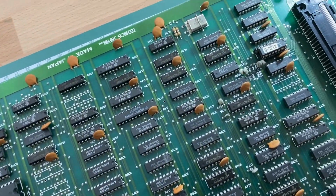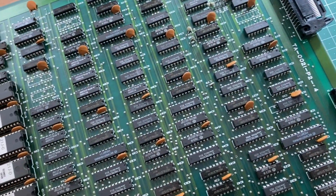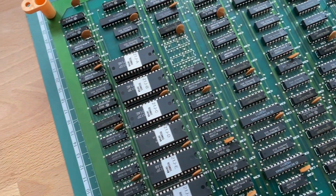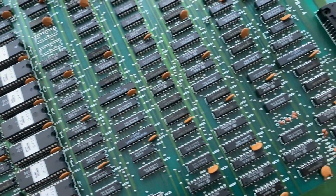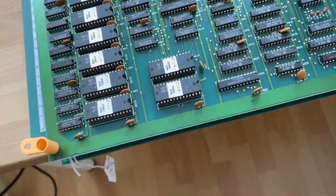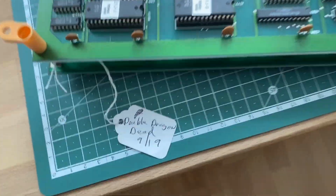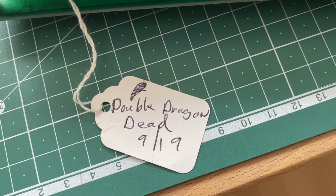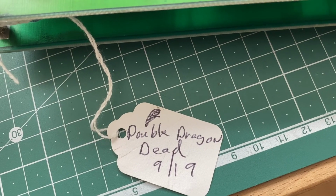So maybe we even have just the problem that the game is playing blind somehow, meaning that there's just a video output issue. But on the other hand, why don't we get any response from coin inputs and control inputs, like with sounds or anything, if the game would only be running blind? Or is there maybe actually an additional sound problem as well? Well, I don't know. What do you make of the situation, and what do you suggest that we could do next?